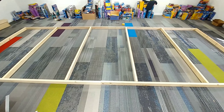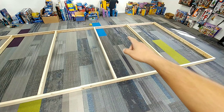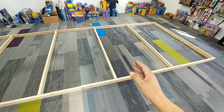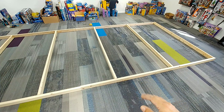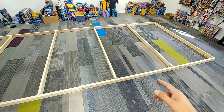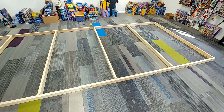Now that I have the basic layout set up, I'm going to start screwing it together. I've got two 10-foot 2x4s on each long side, and six 2x4s in the center at 4 foot on center. The reason for the 4-foot spacing is so when I put the sheets of plywood on top, they can screw to the same board and everything stays at the same even plane. Once this is screwed together, I'll put three 2x4s horizontally at 2 foot on center between each gap, then add the legs, lift it up, and start putting the tabletop on.